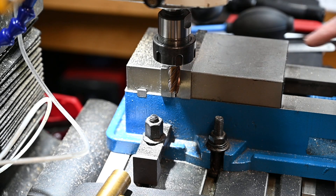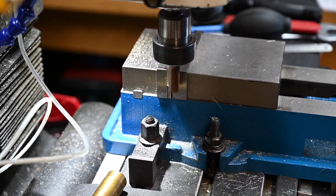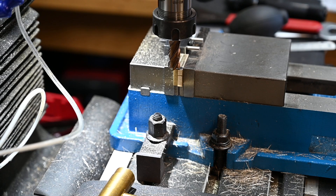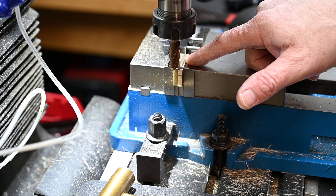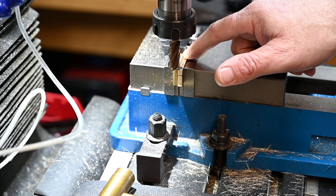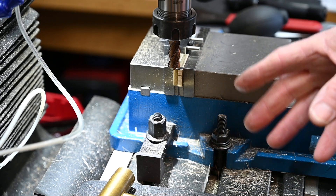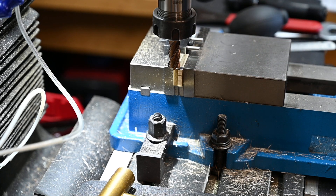I'm just going to mill the first faces off. I've touched off on here — this measurement isn't critical, it just needs to be within a few thou, which I've done. I just touched the edge of the cutter — I could see just a hair between the edge of the cutter and the stock block. I've set the DRO to zero; I'm going to come out and mill it back until it reads 1.250 on the DRO, and that'll give me my exact length.